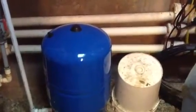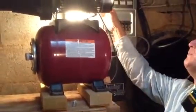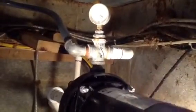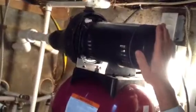These small ones, this actually is a bad one. I guess I should mark it bad. So right behind, there's a lever switch. If this ever is not working up top, there's no water, come down here and push up on this lever switch back here, and keep your hand on it until it reaches 20 pounds. And it'll keep on going up, and once it goes up past 20, it'll take off on its own and stop at 40 automatically. It's an automatic pump that's attached to this cistern.